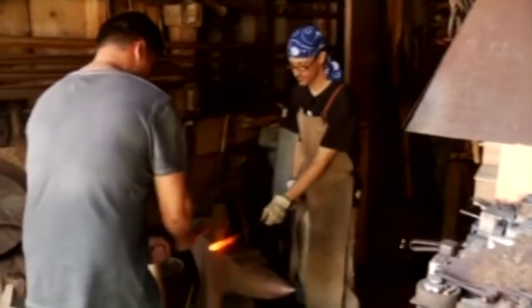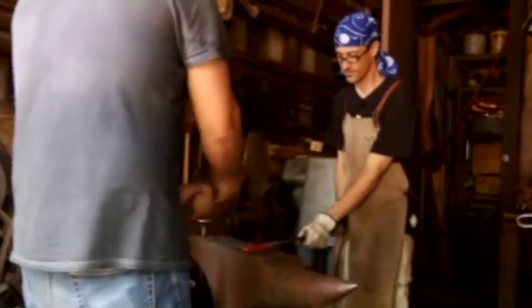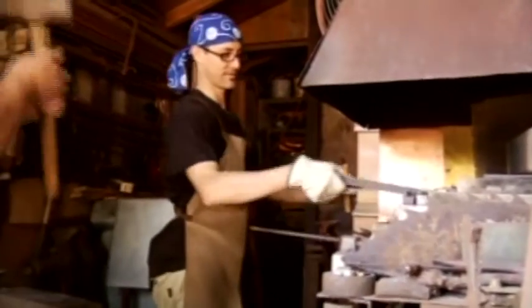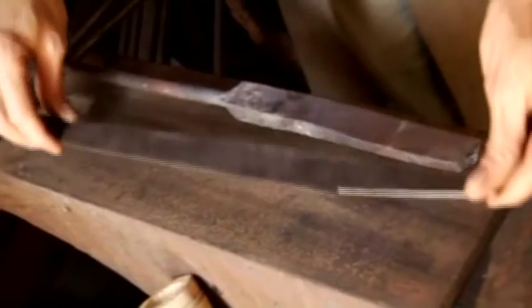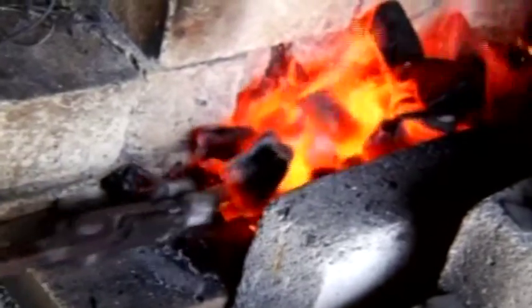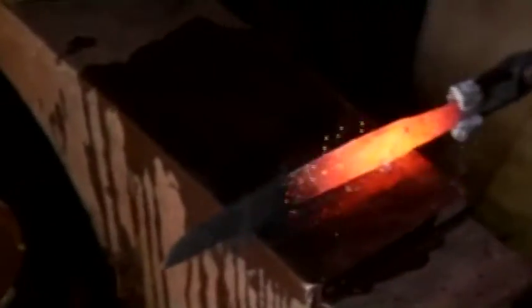Working the steel in this fashion is hard and laborious — the metal remains solid and each stroke does little to change that. At that point I can take a piece of it and begin to forge it out, but it's all done by hand with the hand hammer. There are two stages: first, to forge it into the sunobe form, which is the rectangular blank that distributes the amount of steel for the blade and the tang and determines the dimensions, and then forge it into the shape of the blade.